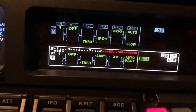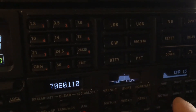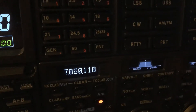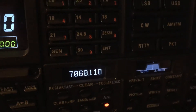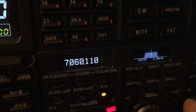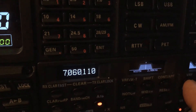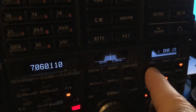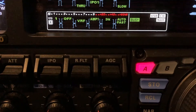But here's what's important — hearing him. So I'm going to reengage, in a different order this time. I'll do the APF first. Now the width, digital noise reduction — I do have it set at maximum. I wouldn't run it at maximum for sideband; usually four or five is plenty. But I am running it at maximum, which is 15 here on CW. And finally, the VRF — tighten up the front end just a little bit. That can help minimize noise from each side of your signal.